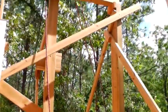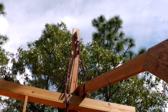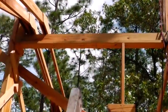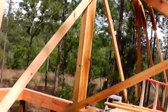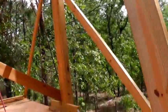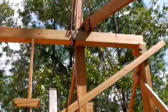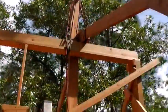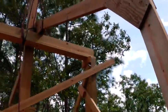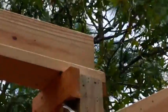Here's a better look at my bracing. I have the ropes tied off to that 2x6 — all I did was drill some 3/4 inch holes in there and run the ropes through them. I have it braced that way so it can't go forward or backwards, same on that side, and then I have the X bracing. The truss is just set up here on that, and I have it tied off with a rope so it can't fall off the end. When I undo that, I'll put a board right there — you can see the screw holes.